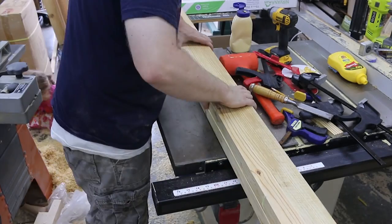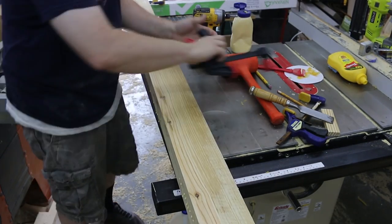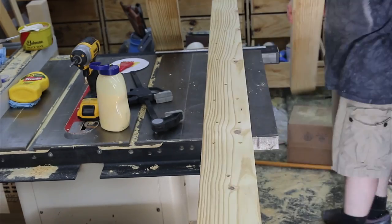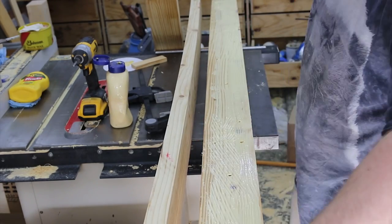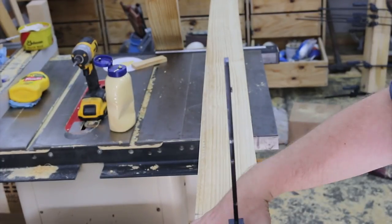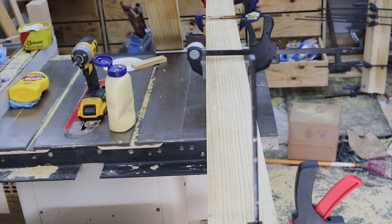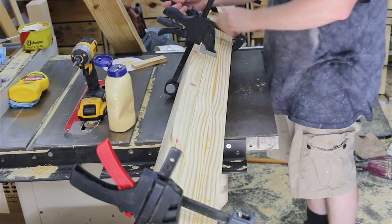In this next section I am laminating pieces together that will form the tabletop. I built it in a sub-assembly manner — I laminate pieces together to create sub-assemblies, then joint and plane those, then laminate the sub-assemblies to create the whole tabletop. Each sub-assembly consisted of four pieces. I use screws to help clamp the pieces, making sure screw locations are well below the final top surface and out of the path of any saw or drill.